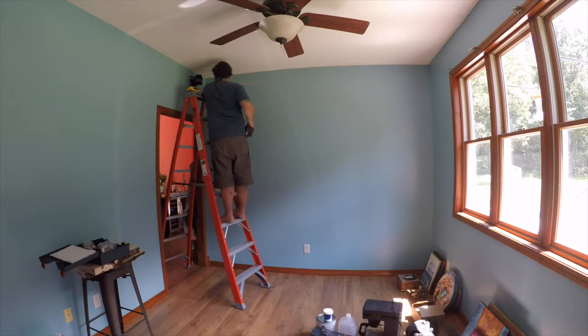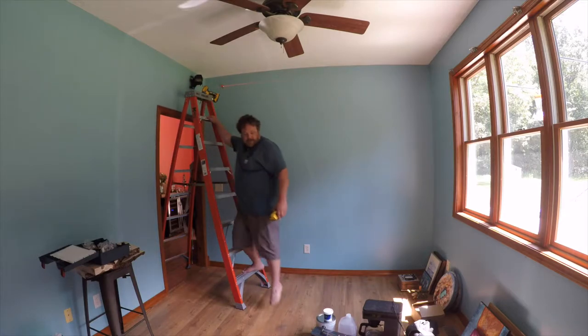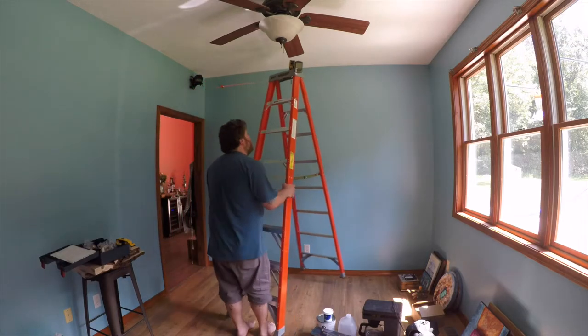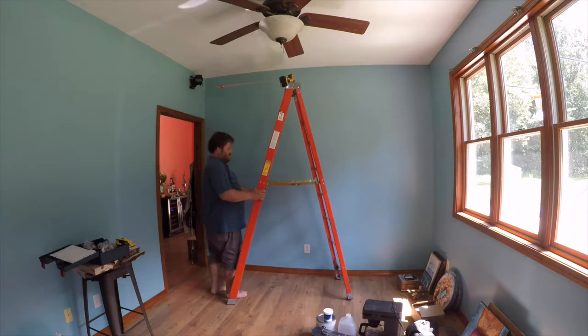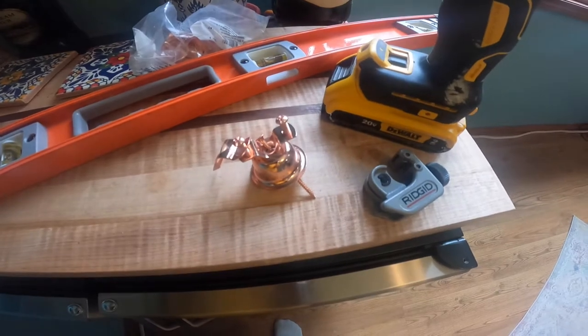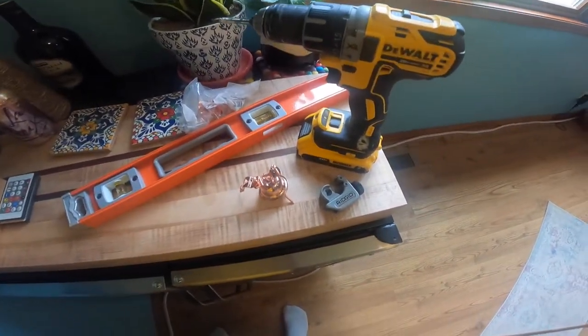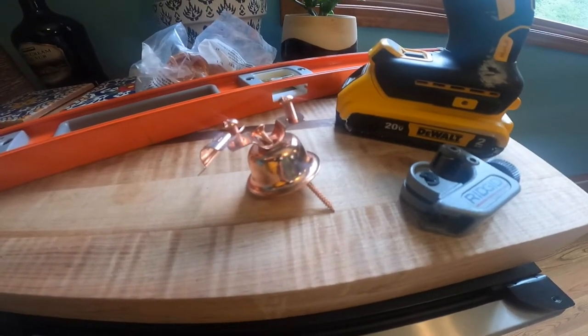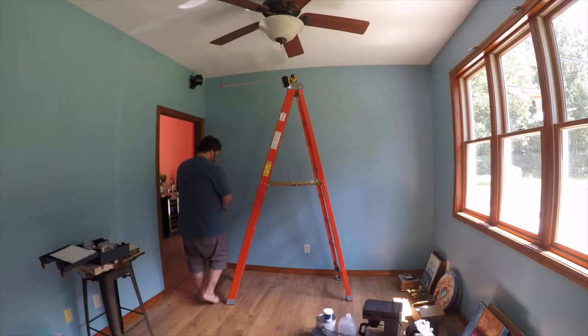The first thing you're going to want to do is measure your walls and the length of picture rail you're going to do, then go buy some copper. I'm using half-inch red plumbing copper — it's $14 for a 10-foot stick where I'm located. Then you're going to need standoffs. I use Bell copper standoffs, which are $1.47 each, and you only need four for a 10-foot run.